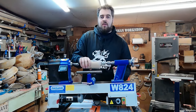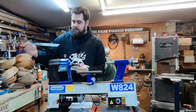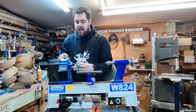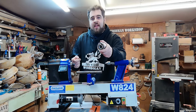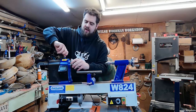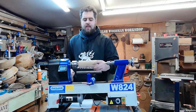Sometimes you'll want to turn a tenon and grip onto it with a scroll chuck. These chucks normally come with a knockout bar you put through the hollow end of the spindle to remove the spur. To fit a scroll chuck you need to know the spindle diameter and the thread pitch. The spindle lock holds things steady while you thread the chuck on. You can then expand and contract the jaws using a chuck key to clamp onto your tenon, and that's ready to turn.